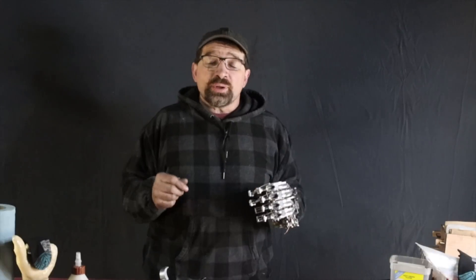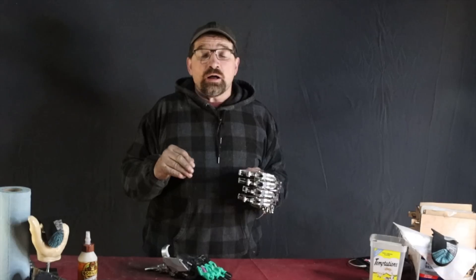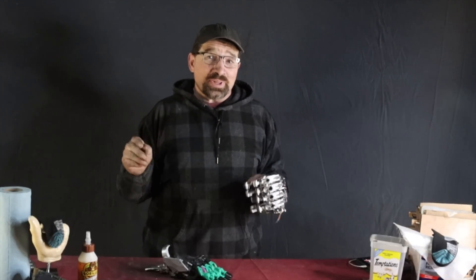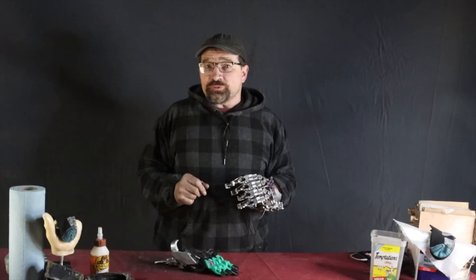When printing in metal, you have to have a minimum wall thickness of 1.5mm. Same thing for holes — anything less than 1.5mm will get your part file kicked back to you. Also, for parts that have tight fit and surface finish requirements, plan on doing some post-processing. What that really looks like I'm not sure at the moment, but I'll let you know in a future video.